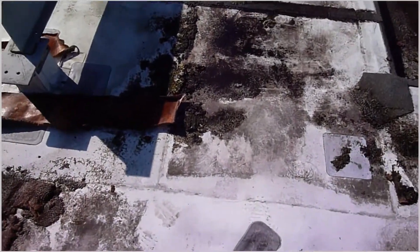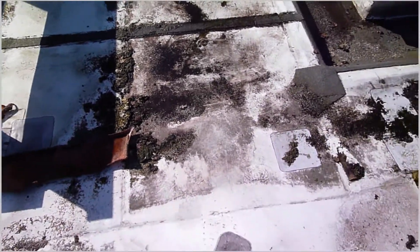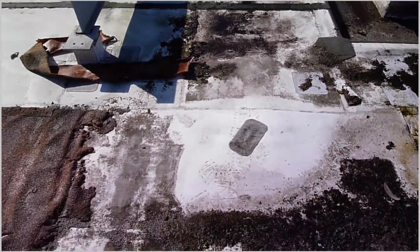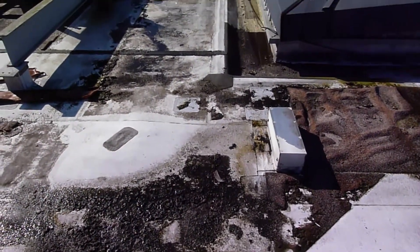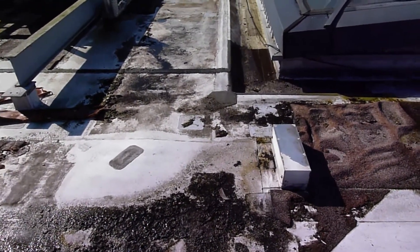The insulation is normally slightly softer — you can feel it underneath your feet — but you can feel it's squelching and you can see that it's bowed up in some places where water's got in. This box gutter on the right hand side here: all too much detail for this kind of system.